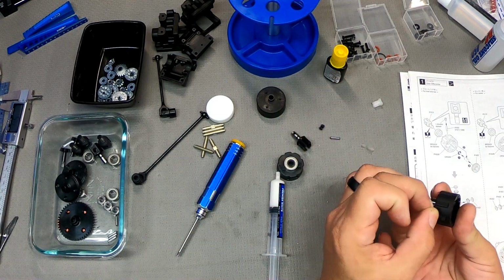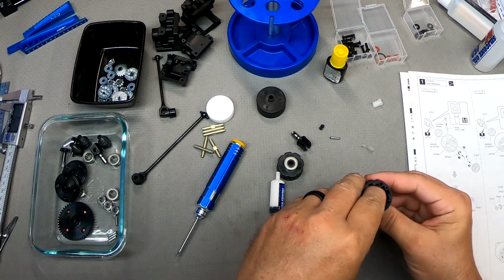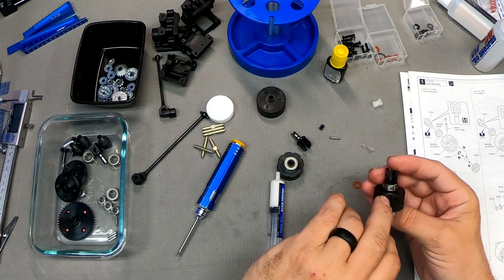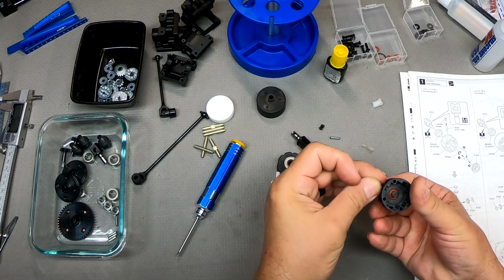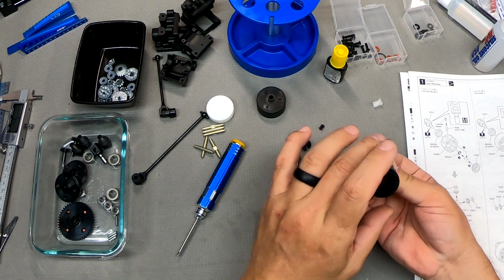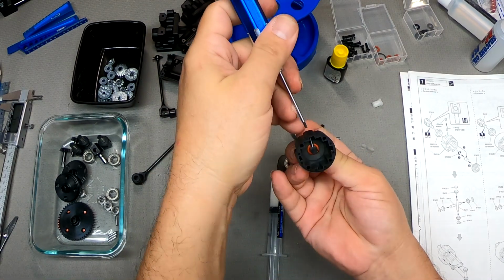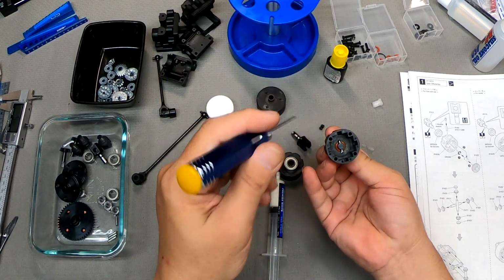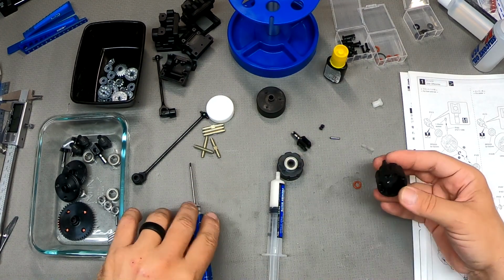So now we want to line up. Okay, you've got a hole here. That's interesting. Just want to make sure I understand what they're asking me to do there. Okay. You're going to slide that down into the, there's a hole through the shaft, and you want to kind of just ease that pin down in here. Now once it's in, it can't completely escape, so even if it moves out of line at the moment, don't worry, it's not going to go anywhere.